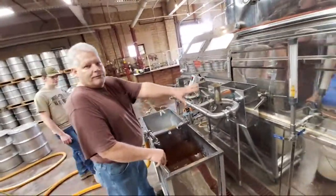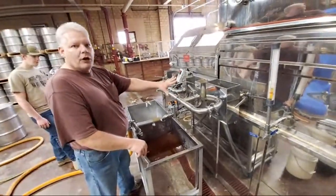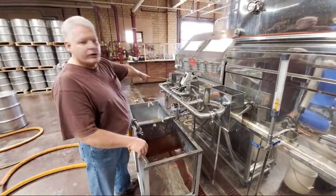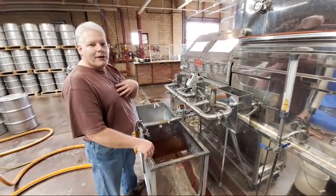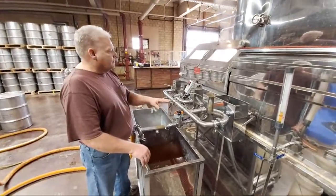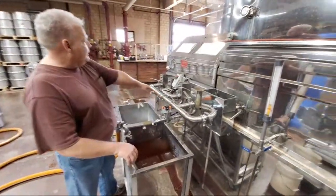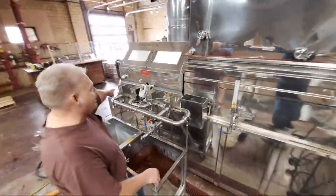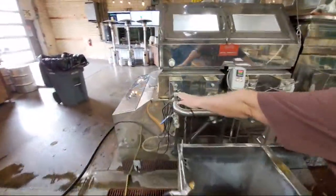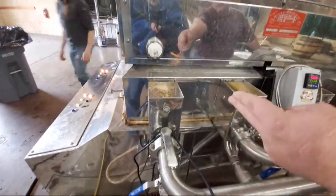It's coming in from the flue pan through the float box. This is a reversible flow pan, so you can change the draw off side. You can draw off here or you can draw off down there. My preference, for whatever reason, seems to be the draw here. It seems like it's easier. It's hotter. So the float box feed, this line, takes it into the very front compartment, that first square up near the front. This valve is open, allowing the sap, almost syrup, to enter.